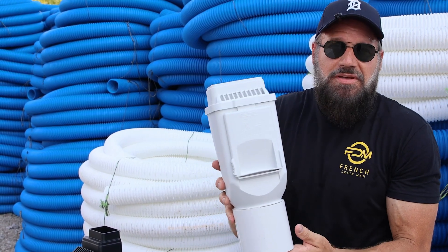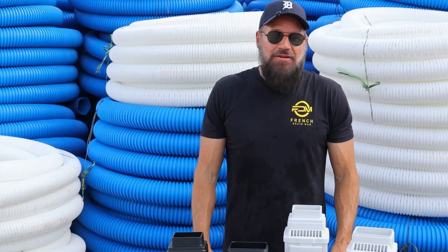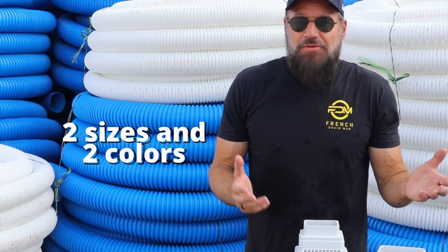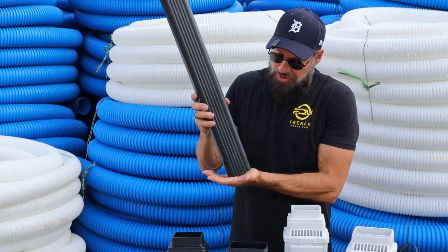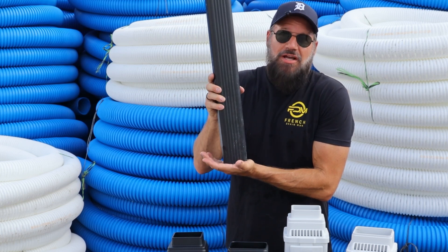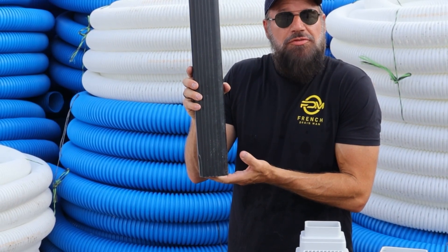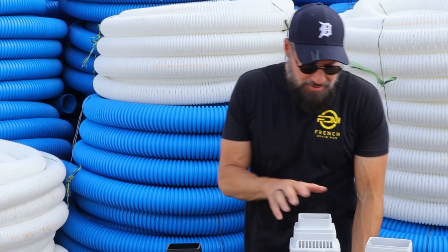This is going to be fair to your customer — treating your customer right. Our vented clean-out leaf filter comes in two sizes: a 2x3 or a 3x4. The way you can tell if your gutter downspout is a 2x3 is if you put a dollar bill up against the bottom of it and it covers it — you have a 2x3 downspout. If the dollar bill fits inside the end of your downspout, you have a 3x4. Or, of course, you can just measure it.